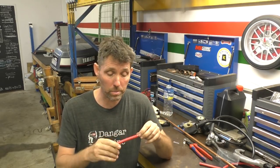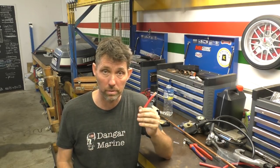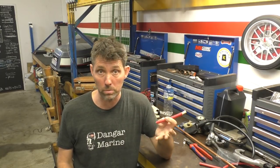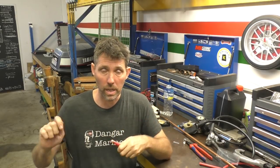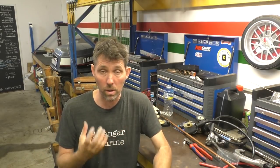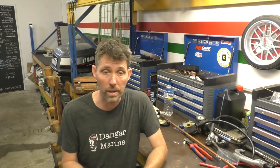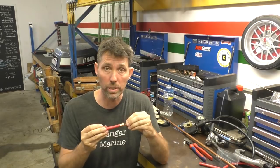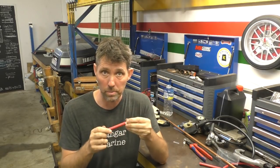Another really good suggestion I've had from multiple viewers is to use the wires from a welder. Welders are designed to have quite a lot of flexibility — quite fine wires, thick, they carry a huge current, but because you're holding the torch and moving it around you don't want stiff wire. They also apparently have a very heat-resistant shielding on them, so in that sense they are actually a really good cable.